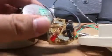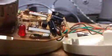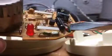Whole thing runs on two 9-volt batteries, which is a lot nowadays, but wasn't that much back in the day, back in '98 when this was built. And let's see, are these ganged together or are they separate? So we got the orange for the flash going to here, from the orange tab here for the battery. Then we have a red and a green tied together in series. Okay, so this thing's running at 18 volts DC, because that's 9 volts plus 9 volts.